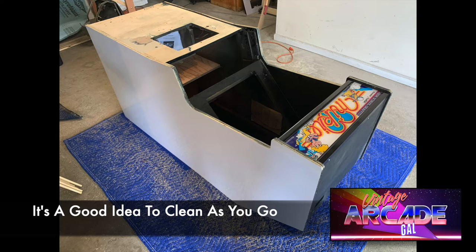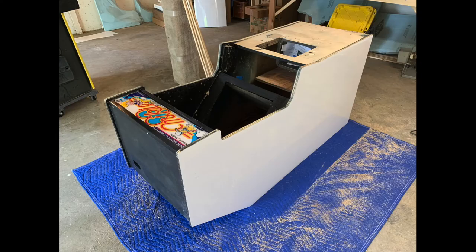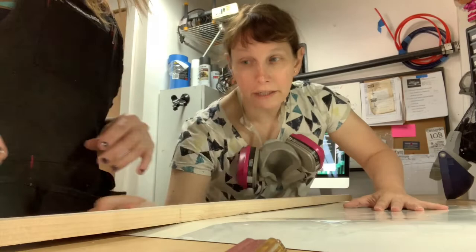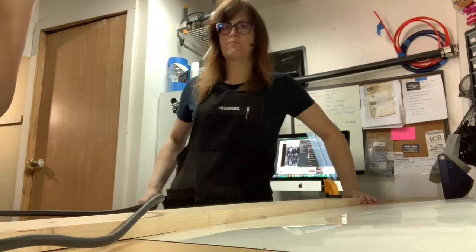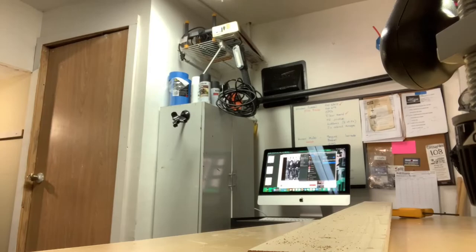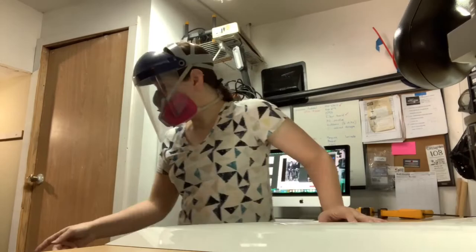The bigger challenge is yet to come because we want to do the front as well. There's a slight lip between the sides and the center, which means the fit has to be very close — we can't trim the left and right sides along the top and will have to cut out the middle for the coin door. In a perfect world you'd build the cabinet first and assemble it around the laminate, but you don't always have that luxury when restoring. So we cut a piece of laminate, measured it, trimmed it a little bigger left to right, then repeatedly went back and shaved off another sixteenth of an inch to whittle it down to size.